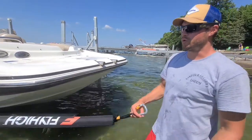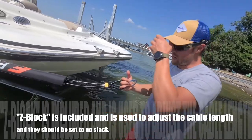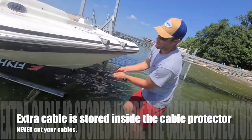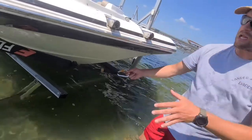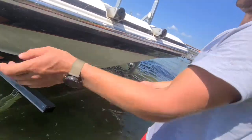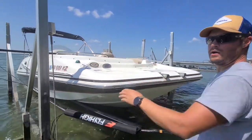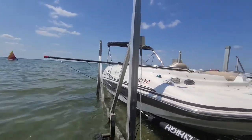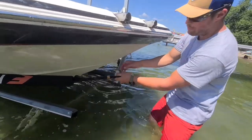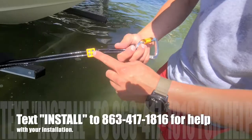Now that the boom is assembled and laid across the boat in the position we want to ski, the next thing is adjusting your cables. These cables come adjusted quite long — for our boat we ended up taking out about four and a half feet. We found it worked best to pin this onto the boat and have someone hang and pull forward. If you look at the red handle or red mark there, we had someone hang and pull forward while out on the water — that gave us the proper amount of slack. We pulled these cables through to a good spot.